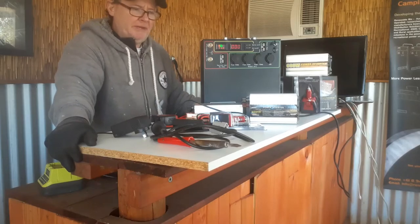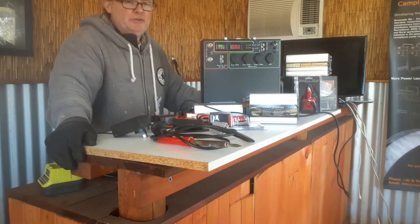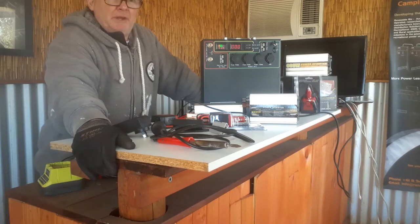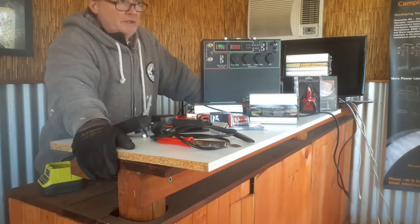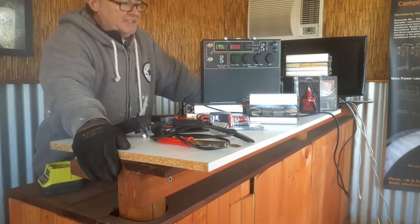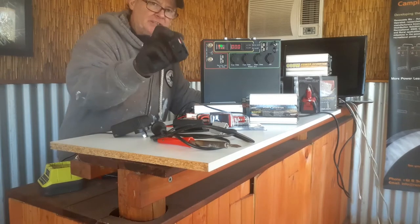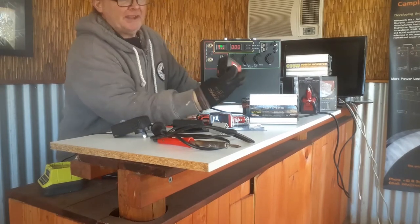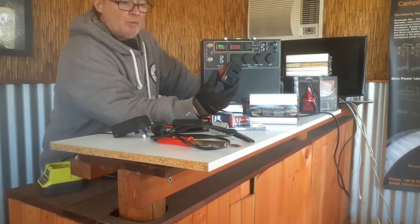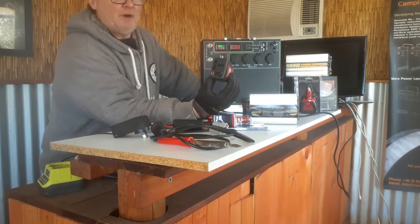Thanks again at Nomad PDU. Today we're specifically talking about inverters, with a number of people out camping at the moment and new to the outdoors. They're very concerned about what they can do with an inverter, what size they should get, and what they can run from it. The biggest mistake people make is they get an inverter and think that because it has a 240-volt socket they can plug a plasma TV into it — but you can't. A plasma might draw 500 to 600 watts.